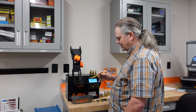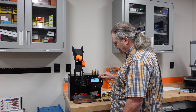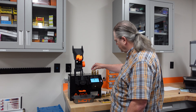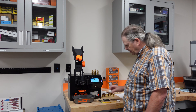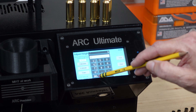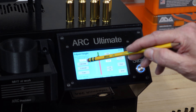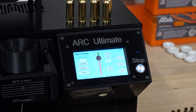You'll notice I'm using just a number two pencil as a stylus — you can use any stylus or your fingers, though fat fingers can make it hard to hit the smaller buttons. There's a section to adjust the height; hit the down button to go all the way down. I'll also take this opportunity to select the correct shell alignment bushing. The measurement we got was 41.36 millimeters. Click on the window, delete what's there, enter 41.36, hit OK, and then hit the calculate button. It will display a height value of 1034 — remember that number, it's our starting point for the 7SS program.